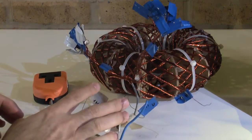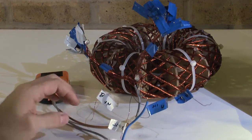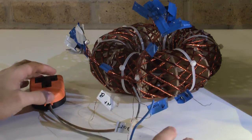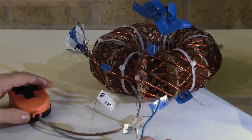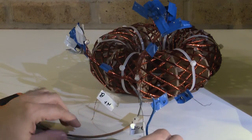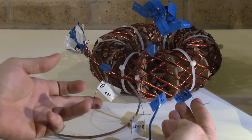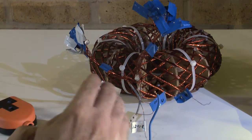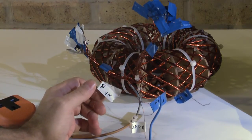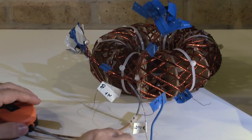We have two wires marked as white in and out, and two wires marked in and out as blue. Not sure what white and blue stands for - probably one is counterclockwise and one is clockwise, assuming. I will connect it as before: in a bifilar fashion with the load connected, and will drive power into the system on the input side. The next step will be to investigate each side on its own, take measurements, and then in the bifilar configuration connect them and do measurements.